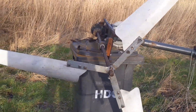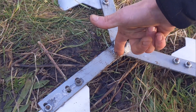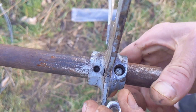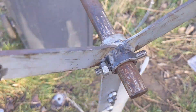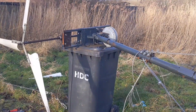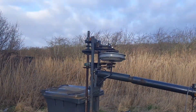That's how they go on — this is the rear view, this is the front view. The other set of blades goes on here. It's very difficult to get the nut tightened on there properly, so I need to flatten the surface out a bit on either side. That's better — there wasn't enough clearance before to get the nut on there. Nice and flat now. I just need to pull the winch up a little bit so the whole mechanism is lifted up so I can get the front blades on.